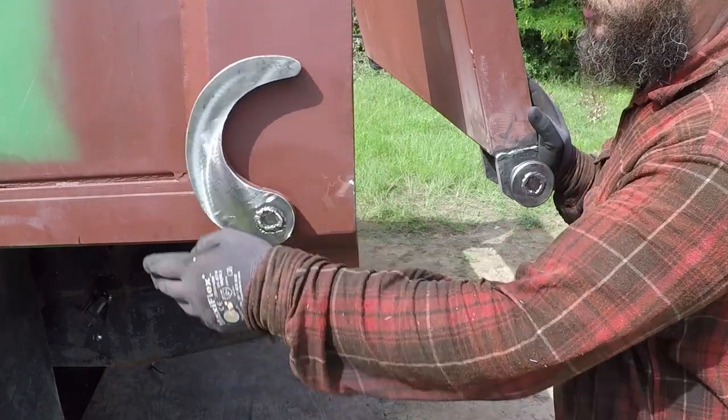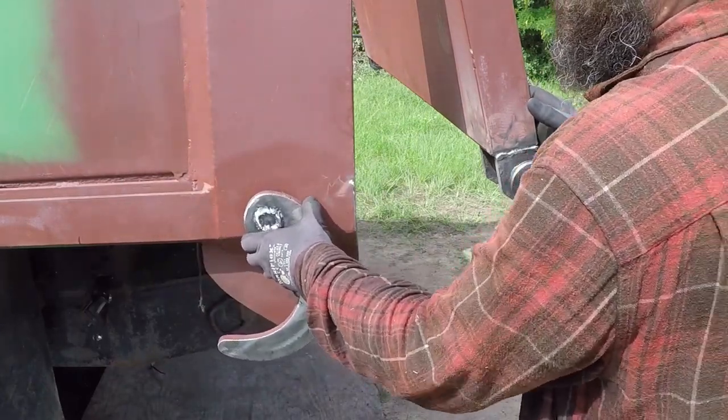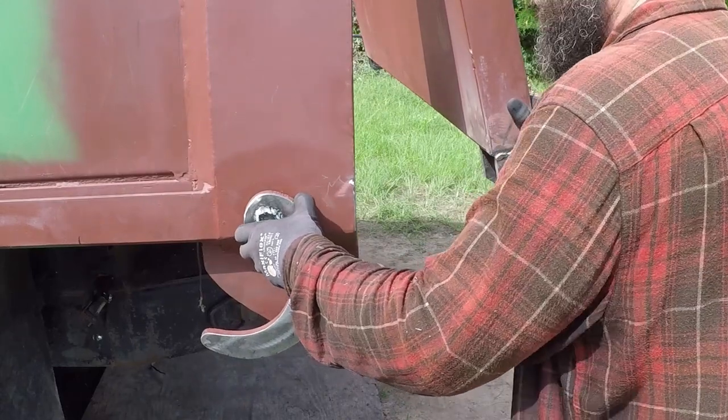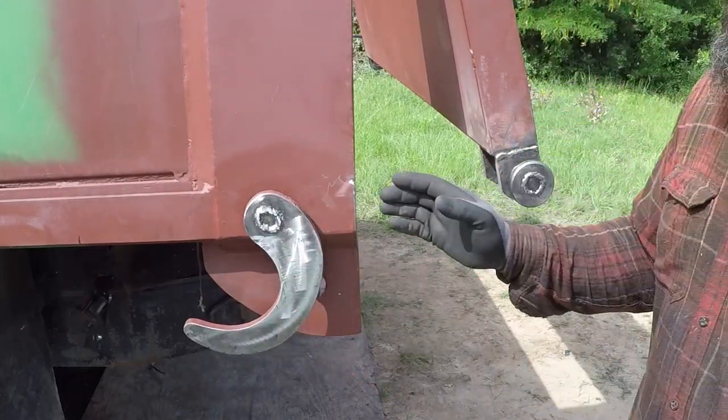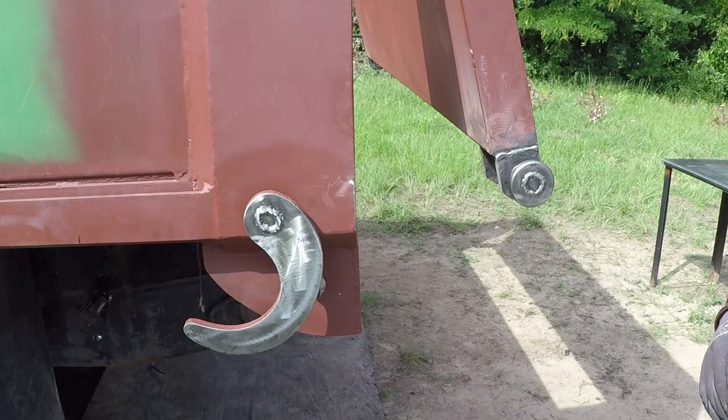Both sides, they're very smooth. It doesn't have play in and out. Maybe 20 thousandths of an inch. You need that type of clearance for grease, etc. But everything came out good.